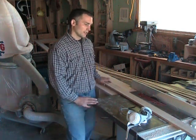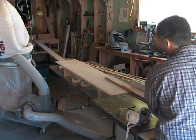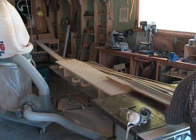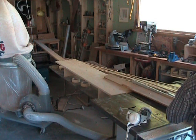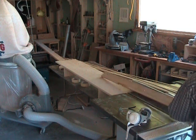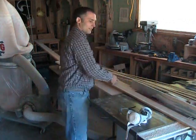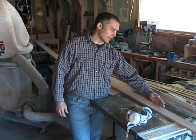So that said, while you're milling your wood and running the material through, make sure that you're always tight up against your fence, and don't pull it out at all. Always have your focus along your fence, and make sure that that's nice and tight. Included in that is that you don't want to be pushing and have an uneven board, because you can see the gap. If I'm lifting up the fence side, then the underside is going to be cut on an angle, and then the next time I might lift up the opposite side, and so I'll have a very uneven board. Sorry, not thick and thin spots, but the board will lose that nice straight edge.